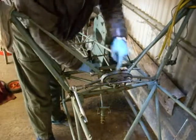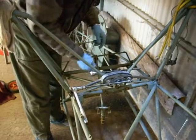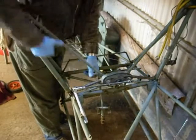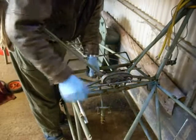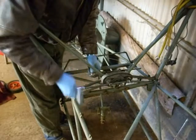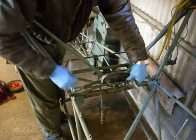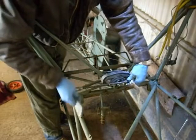So you can see now the rubbers are taking up their form, pushing up against there. That's why the crossover, when you have the bungees, needs to be on this side rather than this side, because it'll tend to hold the undercarriage splayed if you've got the crossover on this side. So the weight's nearly off of the tool now. You can see the guy come out of here, which means the load is being taken now by the stops on the undercarriage.